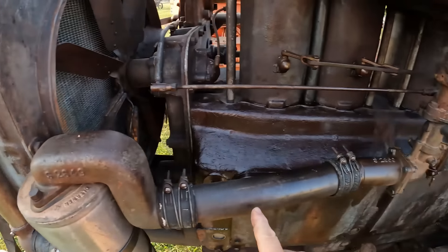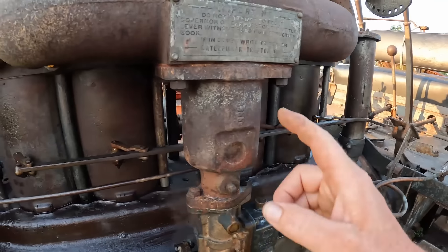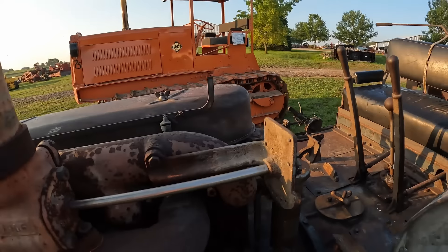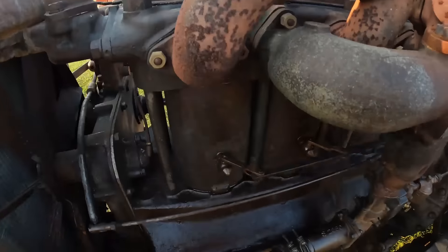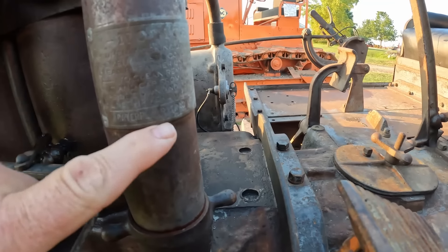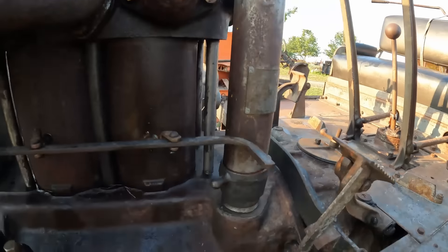After it's cleaned, it elbows out the top and goes into the correct brass Ensign carburetor — it's got the Ensign fuel pre-cleaner strainer on it, fed from the tank drop tube. Perfect-shape intake manifold, perfect shape. We still got some original gray paint left on that heating jacket heat box — excellent condition. Stainless steel shaft comes out to the original heat control lever. Exhaust manifold in perfect condition. We've got some priming cups up top, and the decompressor petcocks on the side all joined together with that rod. Here's the crankcase breather — Caterpillar Tractor Company brass tag on that, looks like it's even soldered.